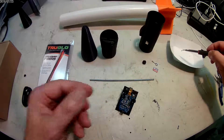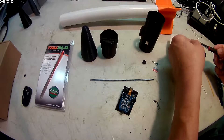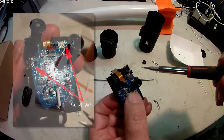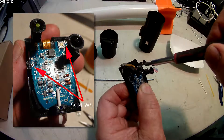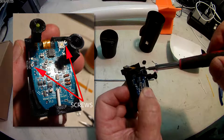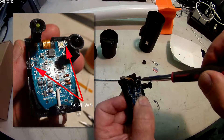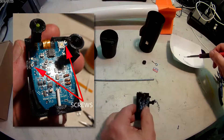Okay, so let's get one of the little silver screws. We're going to put the silver screws into the PC board, into these pedestals — in the corners where you'll see available holes. You're going to have to force them because the plastic print does not accommodate them; basically you're screwing them into the plastic. Turn until they're firm.